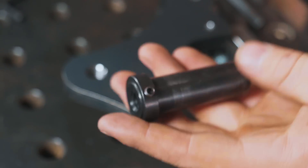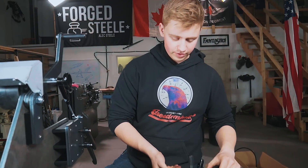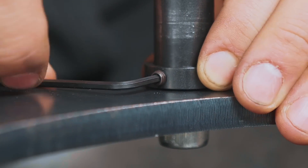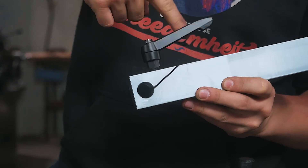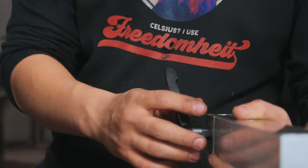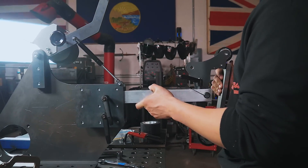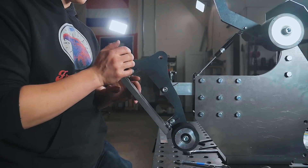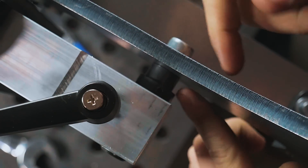The next piece is called the spigot — a funny word, I think it's Australian. Tighten it down with a 5/16-inch allen wrench. We also have a little collar on here, and that collar controls where the platen ends up sitting relative to the belt, tensioning arm, and body. Take the tooling arm with the longer ratcheting handle and start by coming down to the top and tightening the handle down just to the point where it's contacting — don't tighten further yet, or the spigot won't fit inside. Insert the tooling arm into the grinder and make sure the collar placement gives you good standoff distance from the screws. Tighten it down just a bit more so the gap ends up at around 3/8 of an inch.